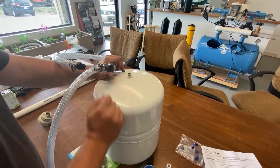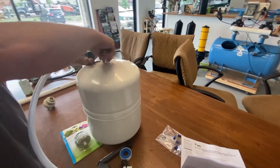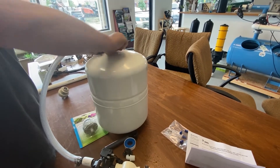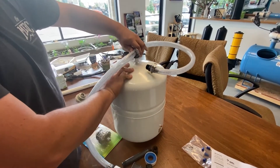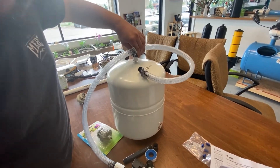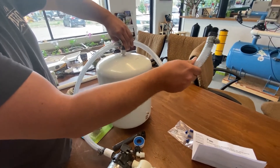Here's the part that will connect to your pressure tank. These pressure tanks will either come with a quarter-inch fitting or a three-quarter-inch fitting, and there should be an included bushing to help them match up. You screw on your pressure tank like this — this adds the pressure accumulator tank portion to the setup — and then this is going to be your outflow.